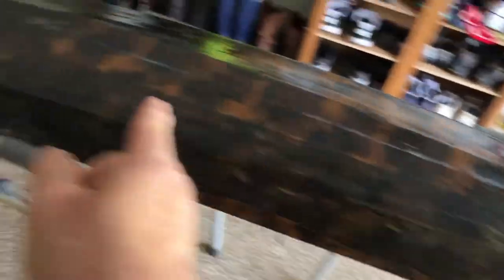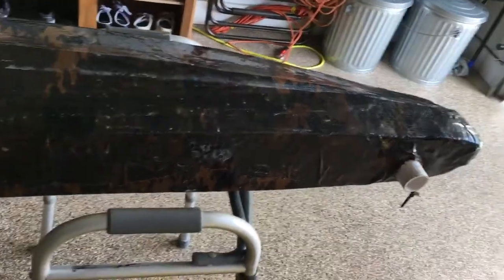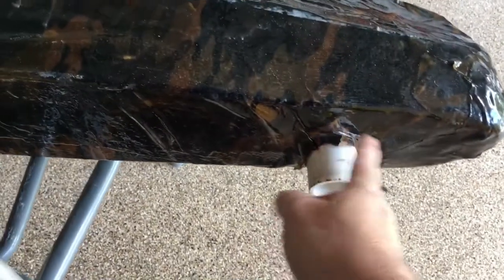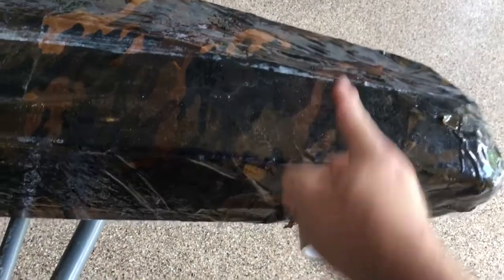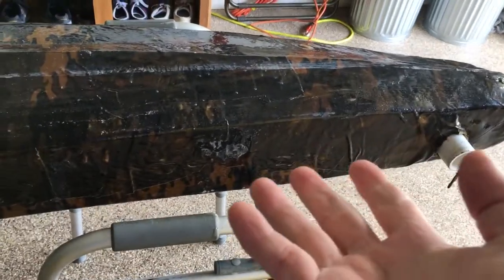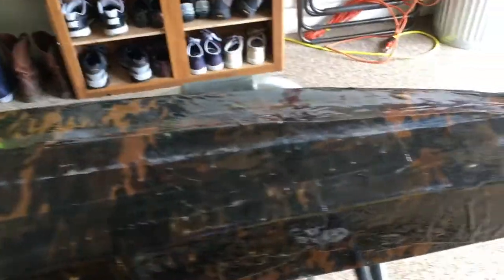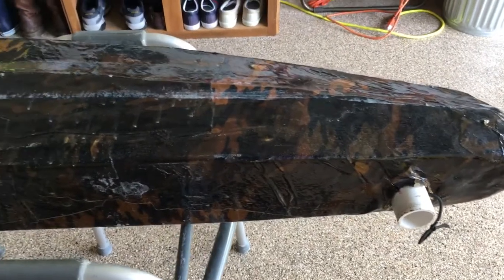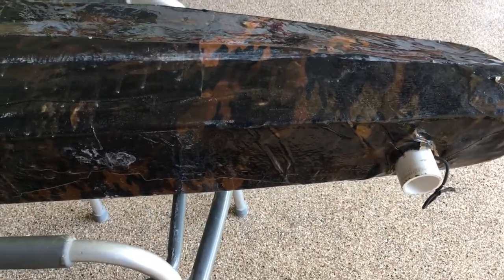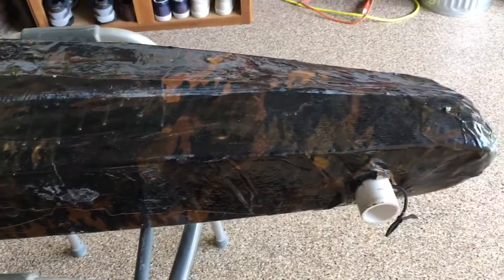Talking to people and doing research, I discovered that just a hollow deal like that — that I could not seal reliably — was not going to get me where I needed to go. So I used expanding foam. I bought a couple of shake cans from Home Depot just to fill in around here to get the PVC locked in place while the epoxy dried. But that stuff strings like spaghetti and leaves a lot of gaps of unfilled urethane foam. So I went on eBay and bought a two-gallon kit — a one-to-one mix, two-pound foam. The higher the pound, the more rigid and dense, but it's not as buoyant. The most buoyant foam you can get is a two-part, two-pound polyurethane expanding foam.